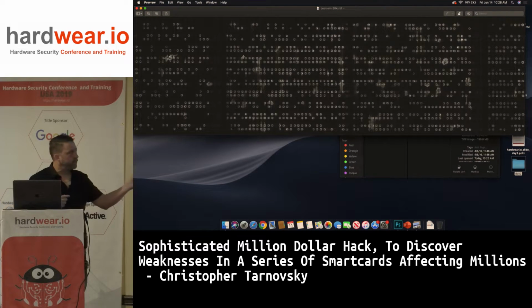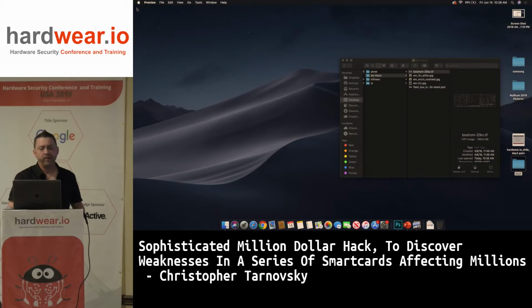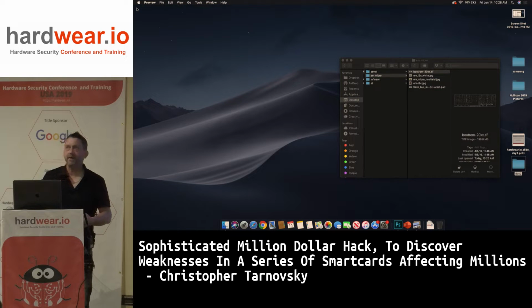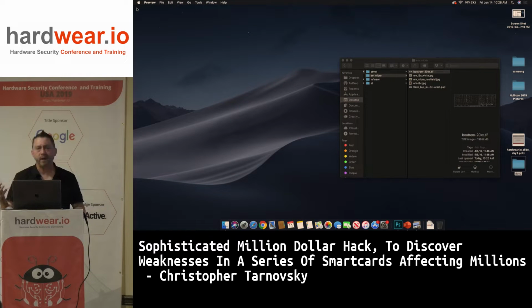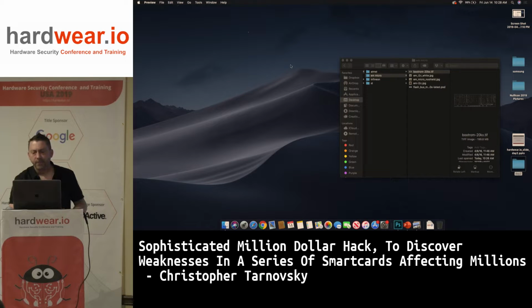So once we got the boot ROM out, we had to get the flash contents out. Now, the chip that I modified, if I cut the boot ROM's data bus outputs, that chip's garbage when I'm done. That chip's just to read the boot ROM, and that's it. So I'm going to throw the chip away or throw it into my jar for later.